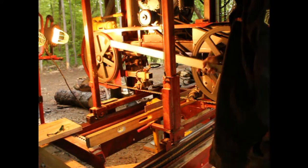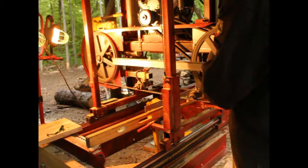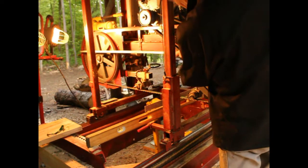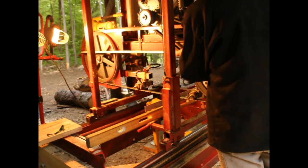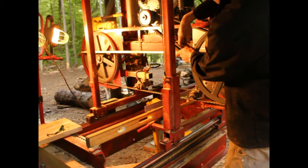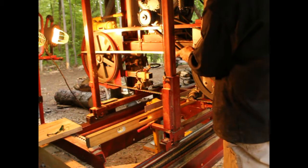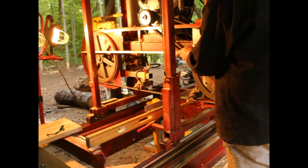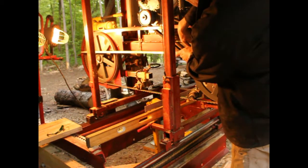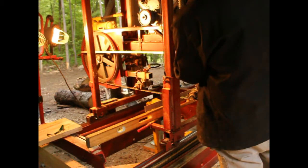The other problem is this wheel and that wheel have to run straight to each other across this way. All I did was make a straight edge that I can lay right across both wheels just above the hub. If it's touching the wheel in all four spots — this edge, that edge, the back edge of each wheel — they're in line with each other. They may be in or out, but they're in line, and that's all that really counts. Now you can adjust your bearing blocks to bring the wheels into perfect alignment, and you can also measure from here to the back of the mount bar on each side to get them the same distance out.